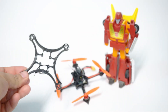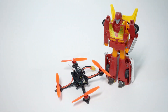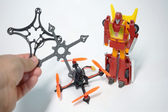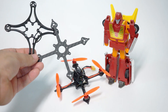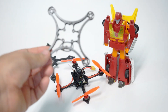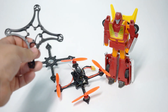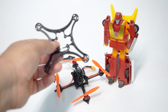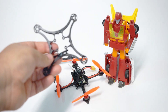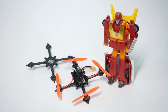One of my more popular recent videos was about this 3D-printed micro frame that you can make out of PLA. I used that to tide me over until this frame finally arrived. But the way this frame is laid out and the hardware that comes with it will make your build so much easier. The PLA version was always designed as a temporary fix — there's no good way to have your screws thread into PLA after a crash; they just come loose. I tried hot glue and it was a messy workaround. Do yourself a favor: now that it's out, just get the real thing.